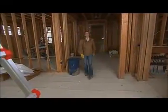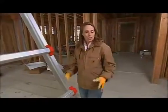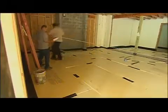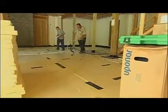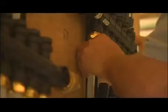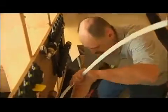Now we want to talk about getting heat into the building. It may not look like it but it is getting a little bit cold here. We're going to show you what we're using to fire up the radiant floor system, but first we should show you what's already been installed. The first component would be the radiant floor tubes that Jason Iverson laid out in the lower level, after we prepped the floor with a thick vapor retarder and some rigid foam insulation. You've seen that pipe before - officially called cross-linked polyethylene tubing but better known as PEX pipe. It carries the heated liquids throughout the house to warm the floors, laid out in a series of loops to cover each part of the floor and then return to a manifold.